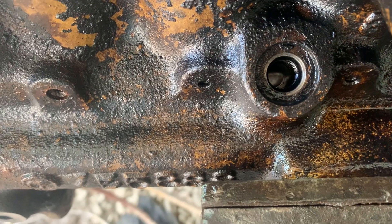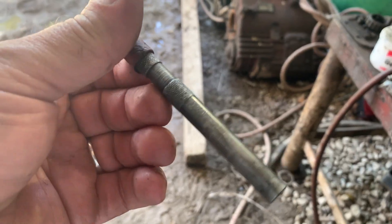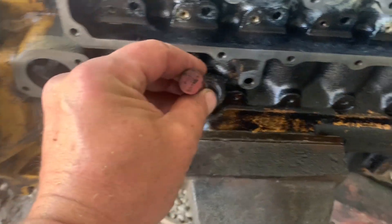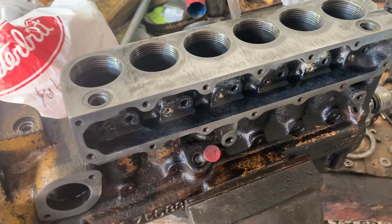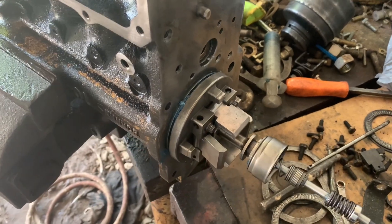So I am looking for the pin. Can you all see that? See the groove? Now there is a special timing pin - I'm sure it is a certain size, there is a part number, but I can't make it out. You can get these in a lot of different places. You put this right here to pin this on number one cylinder, which needs to be done before it goes on anyway. That will lock that cam from turning so that I can tighten these 12-point bolts to the final torque.